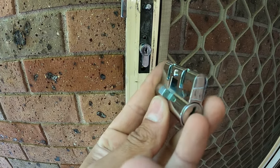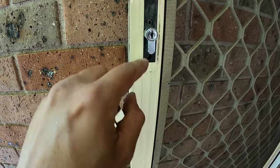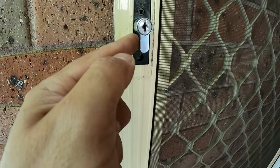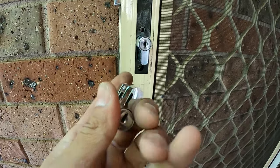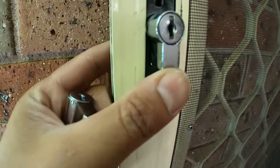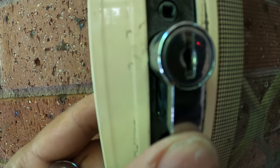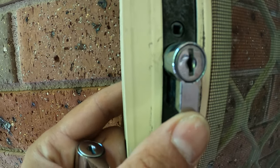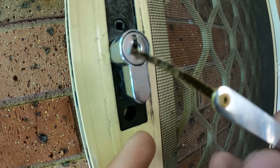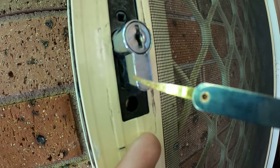What we need to do in this case is get a little piece of thin metal and slot it in between the euro cylinder lock and the actual lock body itself. That's going to let us manually move that cam up out of the way. You can use anything around the house depending on how much clearance you've got — there's not much room here, so it'll be a little more difficult. I'm going to use an old picking tool that I snapped the tip off a long time ago.